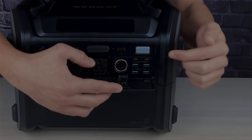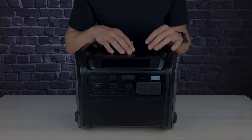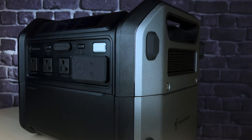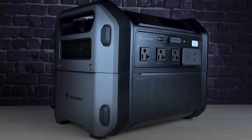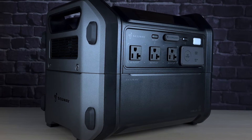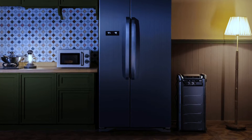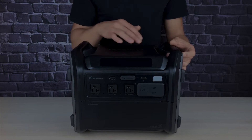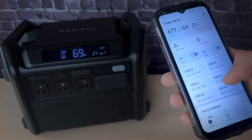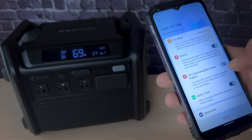What's nice about the two USB-C ports is they're both delivering an impressive 100 watts for rapid charging of laptops, smartphones, and other high-power devices. The Cube also features a switchable UPS function. In UPS mode, the power station acts as a buffer, instantly switching to battery power without any disruption to connected devices — particularly handy for sensitive equipment like computers. It's worth noting that UPS mode may consume slightly more power, so the ability to switch it on and off provides added efficiency.